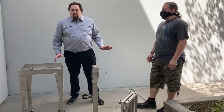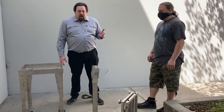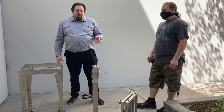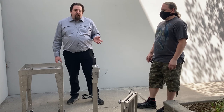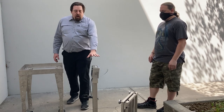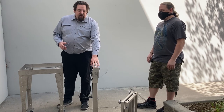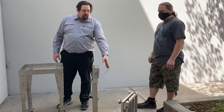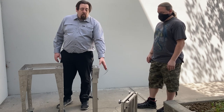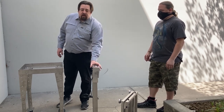For this next procedure, I've enlisted the help of one of our staff. It is recommended, because of the weight of the scale and the potential for damage, that we do a team lift. I'll lift the indicator and the column and show you the procedure, and Daniel will take care of the scale so we don't damage our home run cable or cord from the load cell. He'll be placing the scale into the frame.